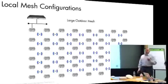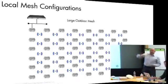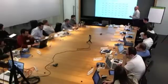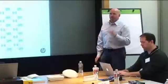Even in a repeated environment, typically it's going to be a facility, your repeater, and another facility out here, for connection. You also have to be careful when you're doing backhauls with what you require for performance, including latency, not just bandwidth, including the latency to get out there. Those are considerations you always have to take into account when you're setting these up. Okay. Any questions on those features?